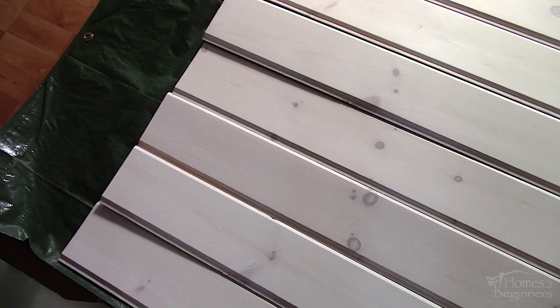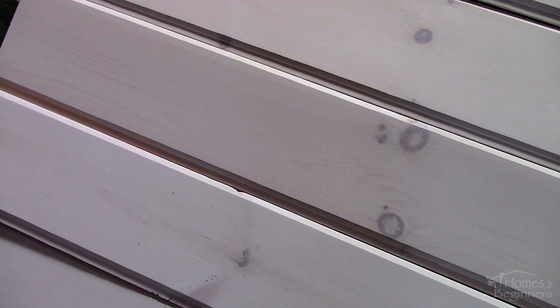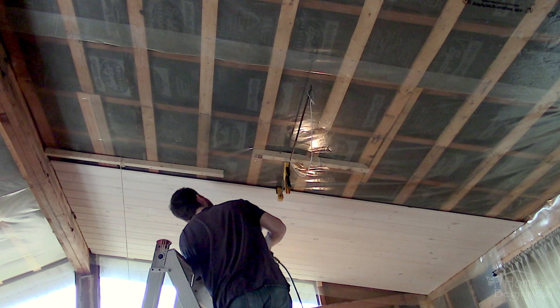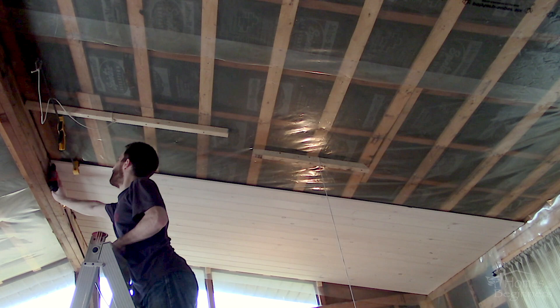The boards were left for 12 hours to dry just to be safe, though this may vary between paints and will most likely be dry in just a few hours. Here you can see what they look like before installation — they have a smooth finish with no gloss. There is no need for a clear coat, however it can be applied if you wish. The tongue and groove gets installed on the ceiling using a brad nailer, with all nails applied in the tongue portion so everything is hidden and there's no need for any touch-ups. I won't be covering the installation as that will be saved for another video, so be sure to stay tuned for that.